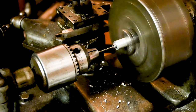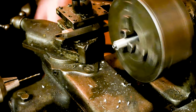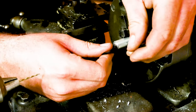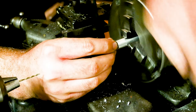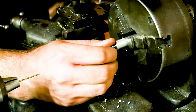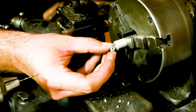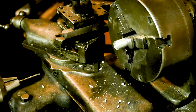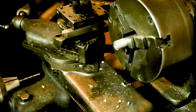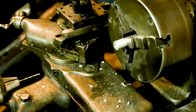Work through. If you guys can see that, just a little drill hole through that vents that whole side of the chamber better, so you don't get additional air compression with the spring tension. So you have a much more linear spring rate because of that. That should boost our performance a little bit. And with that, our regulator work is done.